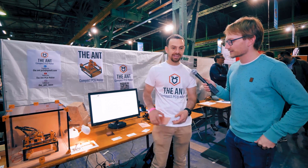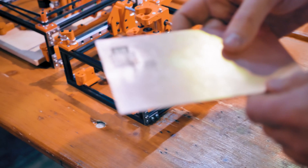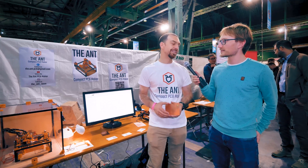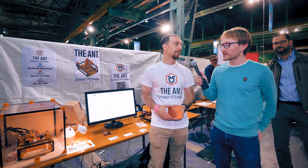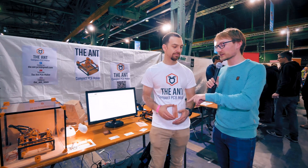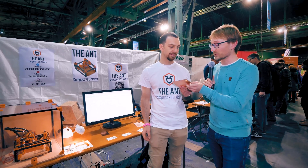It does milling, drilling the holes, the vias, and cutting the board. Up to now we have a precision of engraving of 0.2 millimeters and quite nice repeatability. If you saw my recent experiments with milling PCBs, those worked but didn't turn out so great. What these guys are doing — reliably doing traces between vias or traces between pads — this stuff is good.